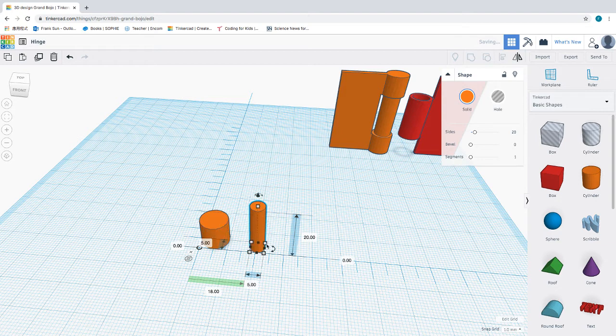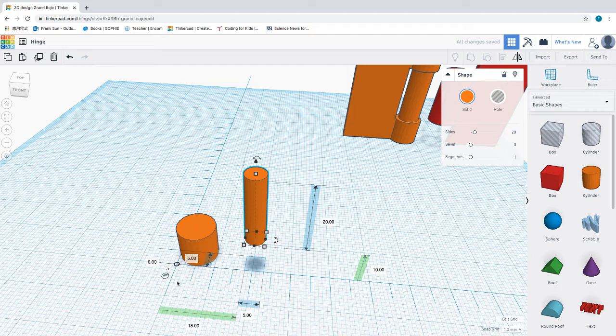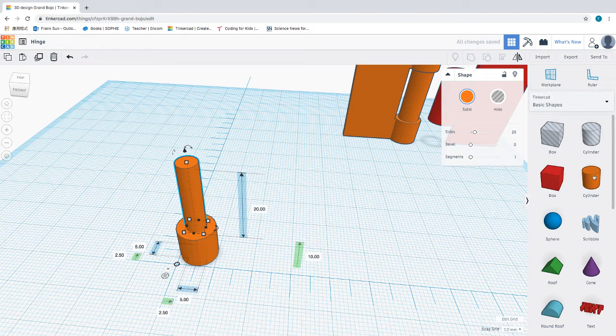The reason I use 5 millimeter is that I want the ring on the outside to be slightly thinner than the ones behind here. I want the ring to be 2 millimeter in thickness — so it's a slightly thicker design. In order to have that 2 millimeter on the outside with a half millimeter space in between the outer ring and the inner cylinder, I need the inner cylinder to be exactly 5 millimeter thick. I'm going to raise this to 10 and set it to center.